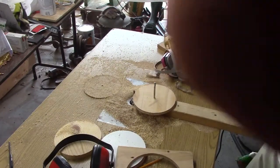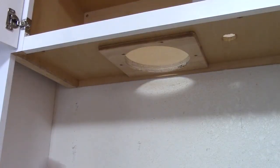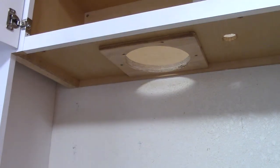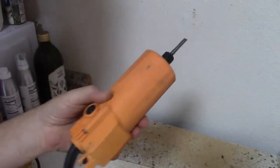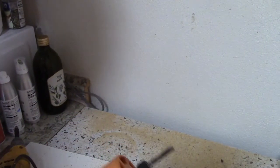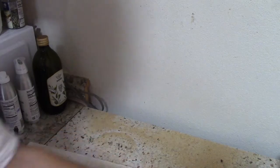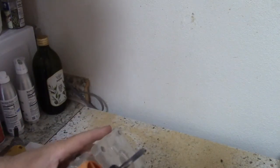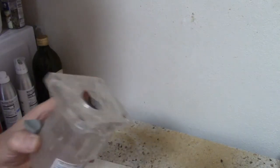Try this one. Okay, so I was happy with the second template I cut. I screwed it to the bottom of the cabinet. I used a cheap laminate trimmer router from Harbor Freight, so I got a couple of these around the shop for different purposes. And I started out with the base unit it came with. I removed the little 90 degree side pieces and used it like this, but I ran out of room against the wall